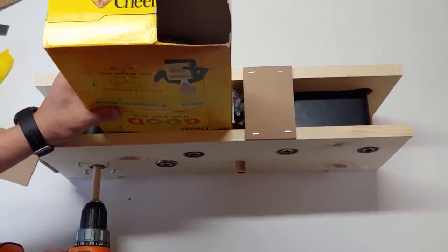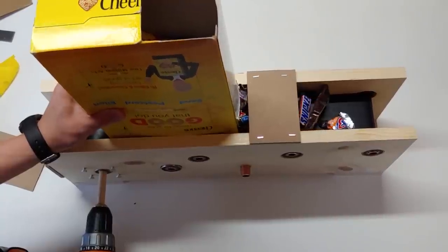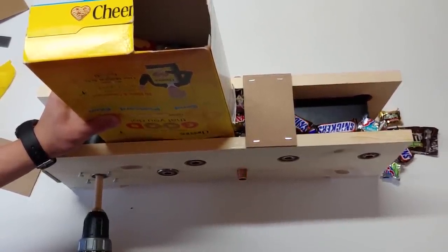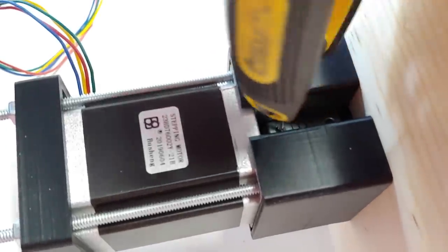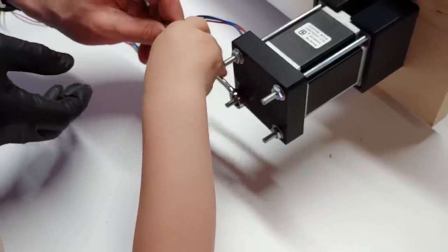With everything assembled, it was once again time to test. And you may notice though that instead of our stepper motor being attached, we had a drill. We were using a drill for testing because it was easier to put on and off than our stepper motor. We designed a motor mount and backplate that were held on by four bolts. A coupler attached the motor shaft to the conveyor. There was a lot of bolt tightening to do, but luckily we had some help from an expert.